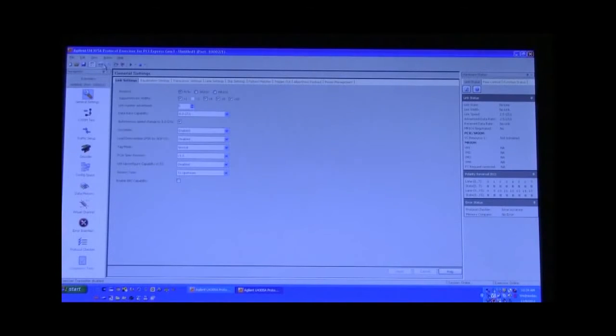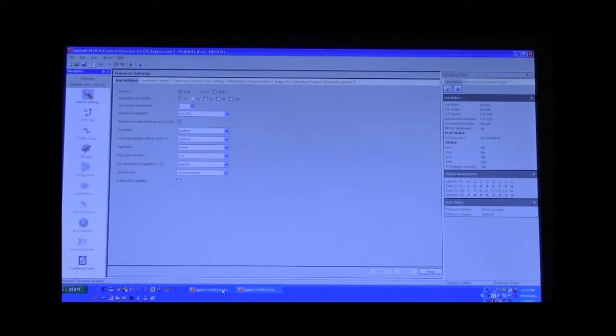And we are going to initiate a link training with this button. So select it. You won't see any change here, but that's all we have to do to set up the device under test. We switch over to our other exerciser card with the windows down below, and you'll see that you're in the PTC because the compliance test window is highlighted.